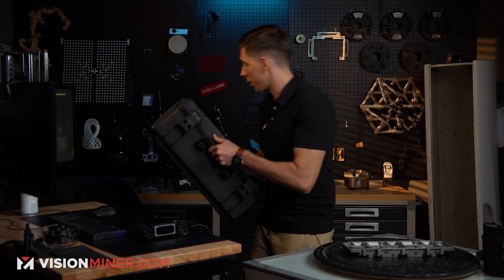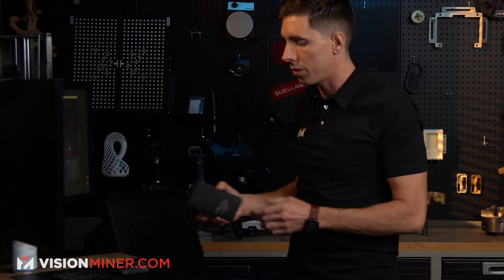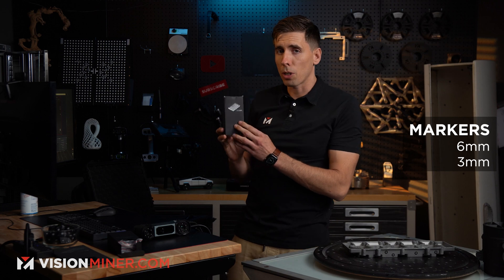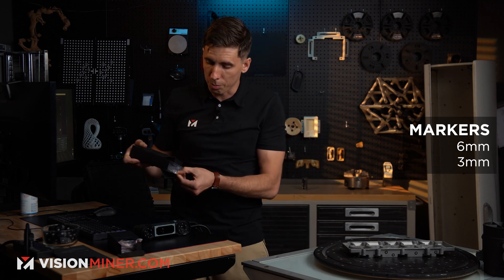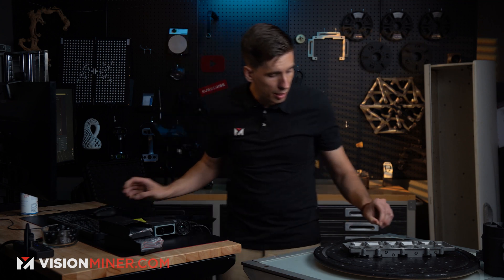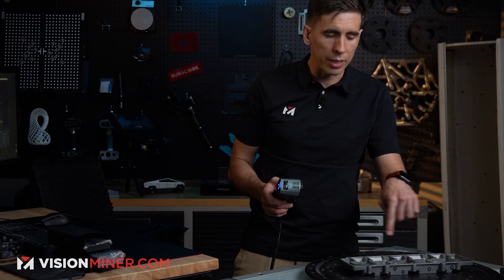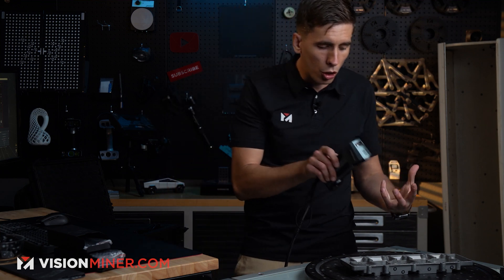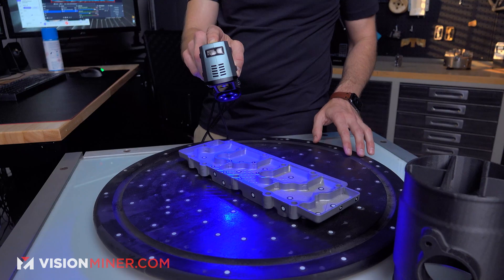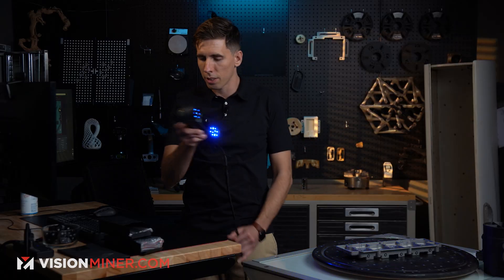I'm going to dive into the hard case that comes with the FreeScan and pull out some of the small markers. It comes with two different sizes: the standard larger markers like you see on the HX and H series, and the smaller 3mm markers — so six millimeter and three millimeter. I'll throw a couple extra small markers around the edges of the scan area, because when you're this close the scanner has a hard time seeing three markers at all times. Adding these markers should help it maintain tracking a lot better.